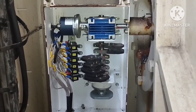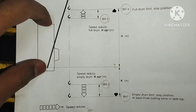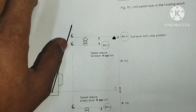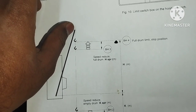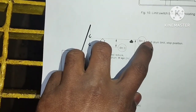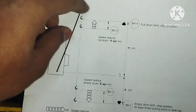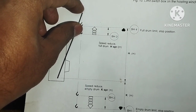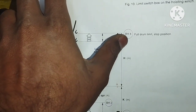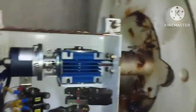Before going directly to adjustment, you have to make sure that you check the drawing. This is the crane post, this is the jib, and this is the hook. To adjust the hoisting limit switch, first position this hook up to a certain distance. It says BH4 full drum limit stop position — there should be a small distance of 1.5 to 3 meters. Adjust the hook to that position and then go to the limit switch.